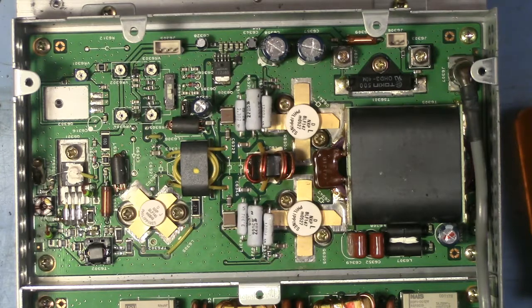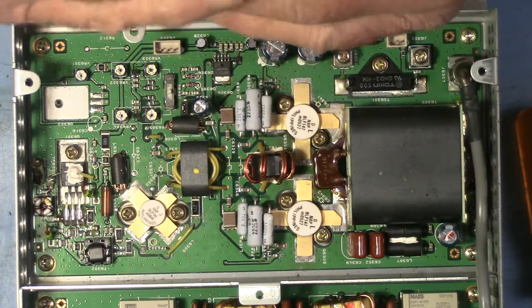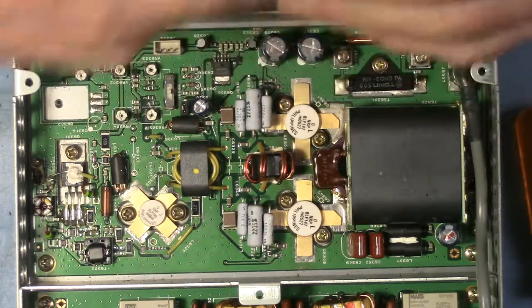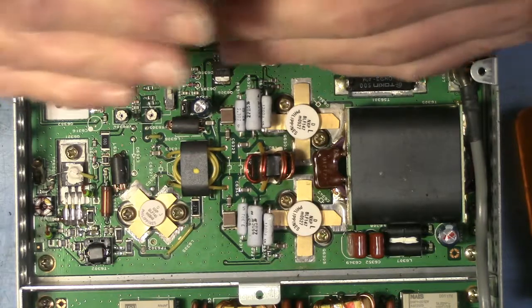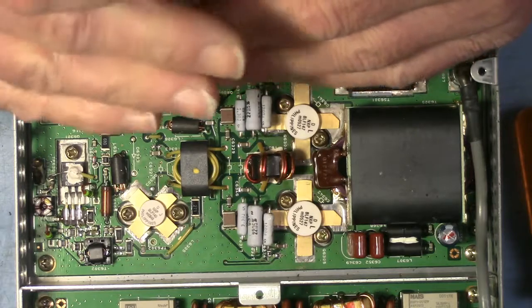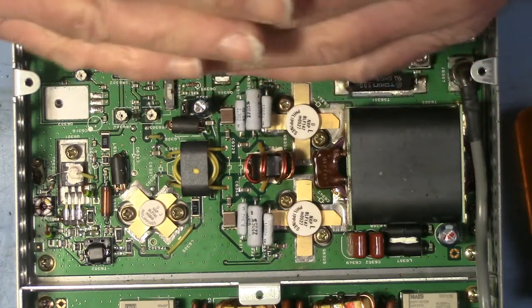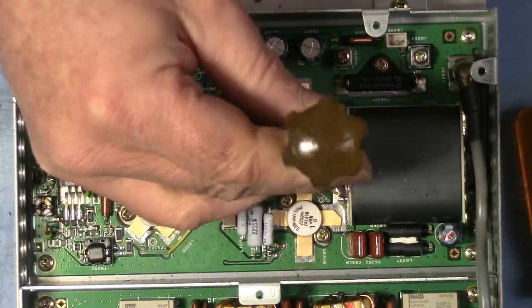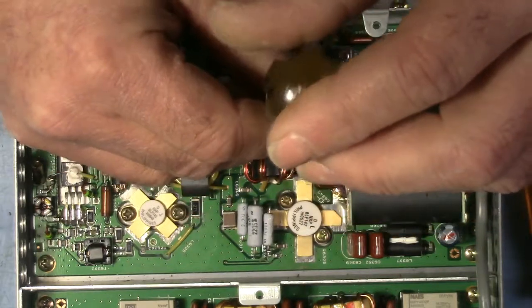So, little trick, very simple, very easy to do. When you put the screw in, don't screw it in. Screw it backwards. Very gently, with very little pressure on it. Turn it backwards. At some point, the threads will slip off of each other, and you'll feel a little click or a little jump. It'll sort of jump down into the hole and align itself with the original thread, and then you screw forward and tighten it up. If you do that every time, you will be putting the screw into its original threads each and every time, and it will hold with virtually its original retention capabilities. So you can take something apart many times and not end up with a plastic case that falls apart. So put the screw in, go backwards till you feel a little click, and then screw forward.